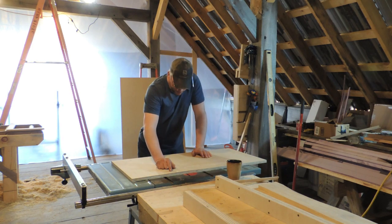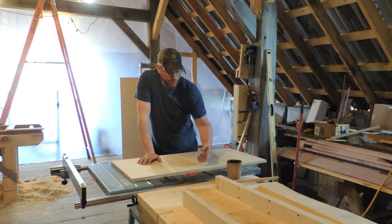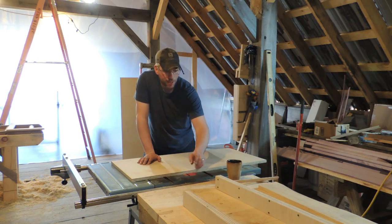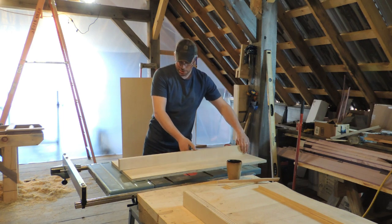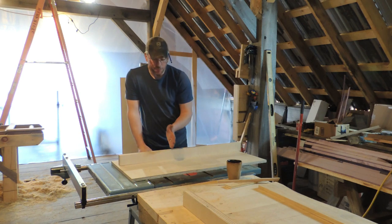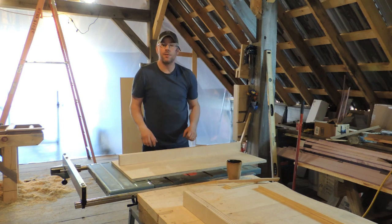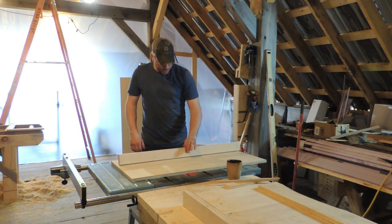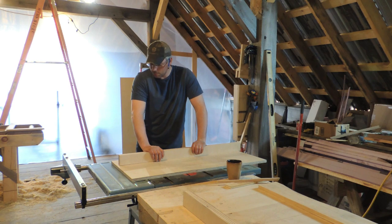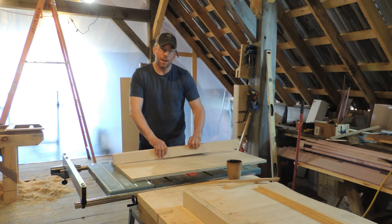We're going to start putting the front fence on, and then we're going to use two screws to put the back fence on. I'm going to use Kreg screws to attach the front fence. We're going to set it in three-quarters of an inch, because we're going to put a poplar face on the front of it with kind of an arch on it. These fences are only two and three-quarter inches tall, so if I go with a pretty wide cut, you've got to have something to support it on both sides, otherwise the board is going to be doing this when you're pushing it through — not very stable. By the time this is all said and done, these end up being an inch and a half thick — two pieces of three-quarter inch birch or maple plywood glued together.